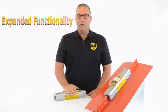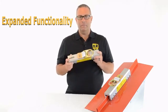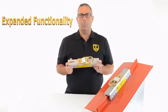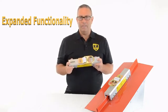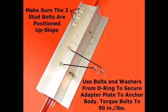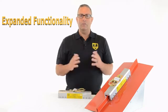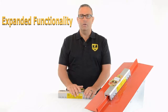Number six covers our adapter plate. The standing seam roof anchor has adapter plates that expand its functionality. For example, if you're installing solar panels on a steep roof and your crew needs walk boards, you don't have to buy separate walk board brackets. You mount this device on the seam, remove the D-ring, and use our SSRA-2 roof jack adapter — it drops over the anchor body and locks on, giving you two-by-ten walk boards across the brackets. It's a simple, cost-effective design that lets you use the same SSRA system for multiple tasks on the roof.